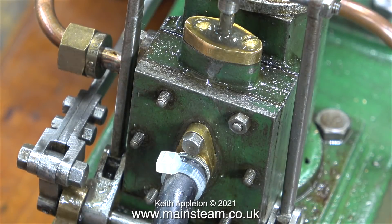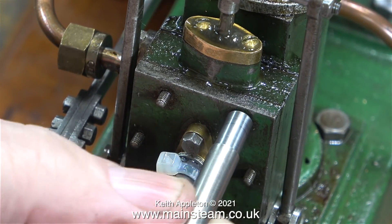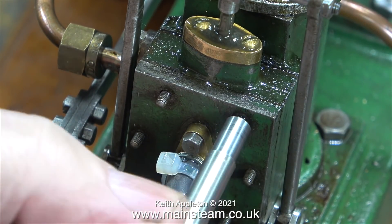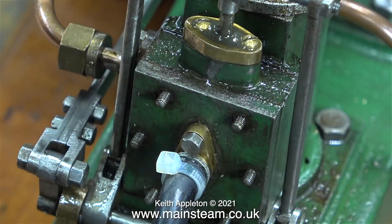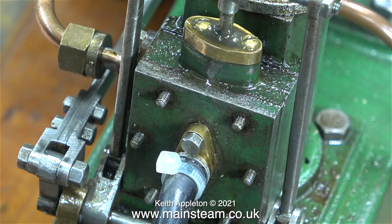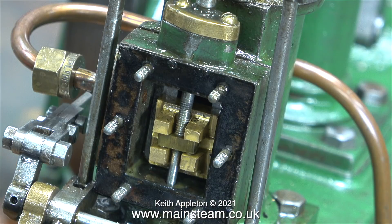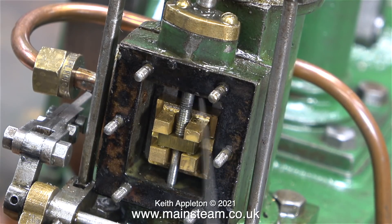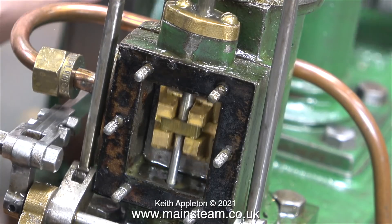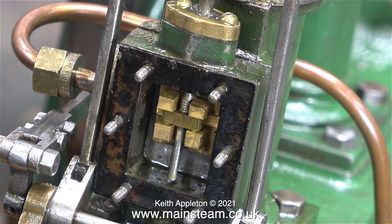It's time to remove the steam chest cover. I've edited the nut removal to speed things up. Here you see a typical example of the law that says the last part of the job goes wrong — I could not shake the nut out of the nut spinner, that's why I refitted the nut to the stud so I could remove it with my hand. Once I removed the steam chest cover, this is what I found inside: a slide valve which is not in the correct position on the valve spindle. It uncovers the port at the top fine, but it doesn't at the bottom. Part of this is to do with the operating mechanism, because the primary operating arm at the left hand side of this image is loose on the shaft.